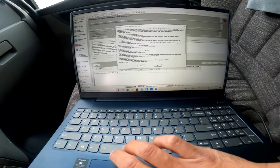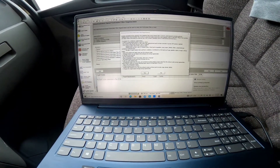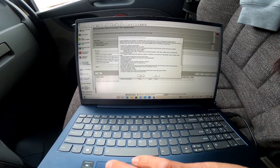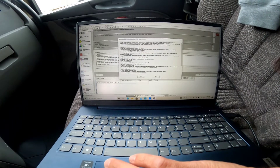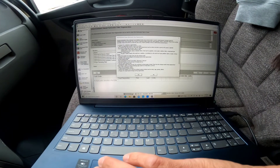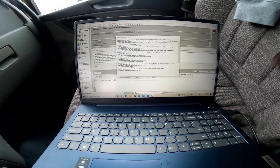All right, I forgot about this one — I'm gonna read this to you guys. During the regeneration, gas temperatures could reach 800°C or 1472°F, and exhaust system surface temperature could exceed 700°C or 1292°F. Expected engine speed may reach between 1000 to 1500 RPM. Please read carefully and follow instructions to avoid risk of fire, property damage, burns, or other serious personal injuries. Select an appropriate location to park the vehicle on a surface that will not burn or melt under high temperatures, such as clean concrete or gravel — not grass or asphalt — away from anything that can burn, melt, or explode. Nothing within two feet of exhaust outlet.